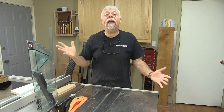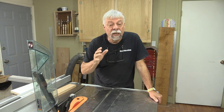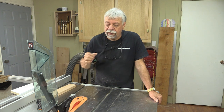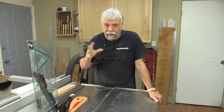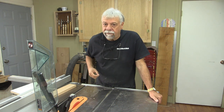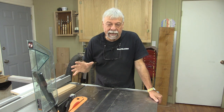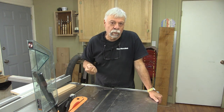In my last video somebody asked why can't you use a cross-cut blade to rip — that's a really good question. There are two reasons you typically don't do that. First, you have to go much slower with a cross-cut blade when ripping because it has many more teeth. Second, if your wood has a tendency to burn, having that many more teeth while going slower through the blade means there's a much higher risk that your wood is going to burn.